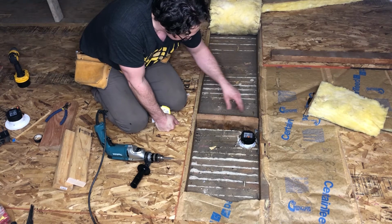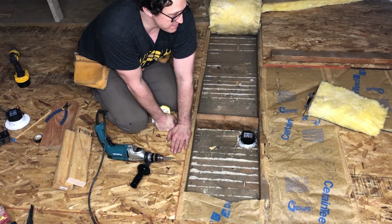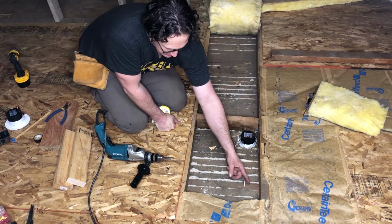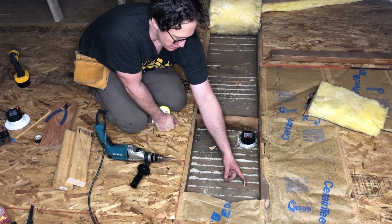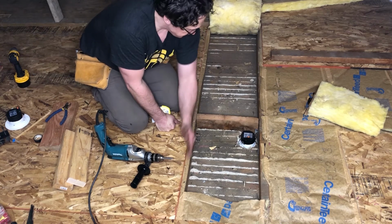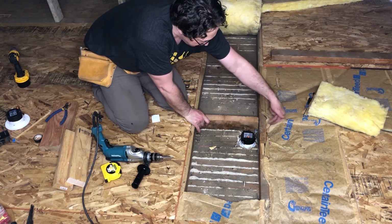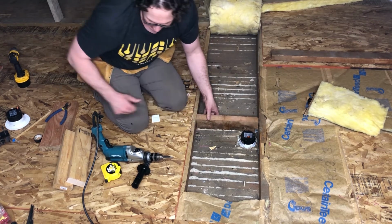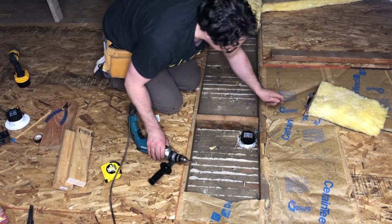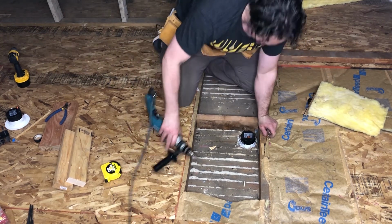Since I've taken this temporary subflooring attic plywood off to expose the joists, we can work here. And you can see our screw that came up from downstairs, this is where we want our hammock to be. And this is the joist that the pole is positioned on. Since I have this exposed, I'm going to reposition it over a little bit, and I'm going to screw it in from the other side, and then just toenail it in from this side. Previously, it was just some long nails that I'm not going to hammer back in. I'm going to actually use some construction screws.